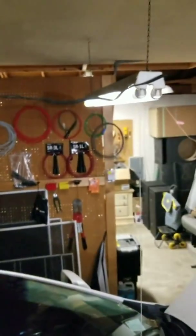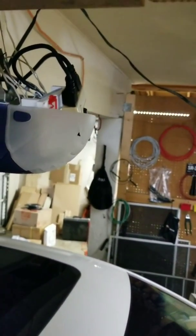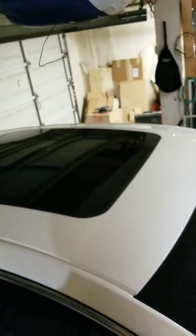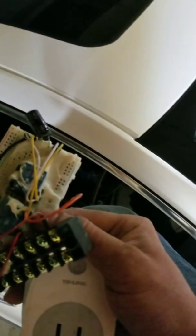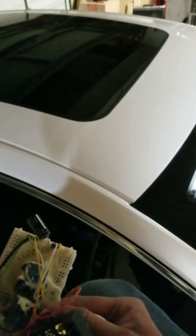Keep in mind it doesn't matter what side you do this on — just make sure you put it on the normally open part and common, that's all you've got to do. Make sure your wiring: you cut it, put a wire in, and then put those two in one, and those two in another. In this case I used speaker wire and a couple of wire nuts. This thing can just chill right here — it's not a big deal, as long as my Caddy's safe.